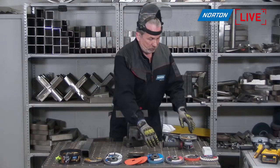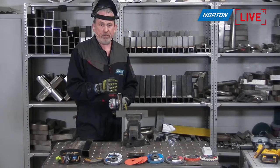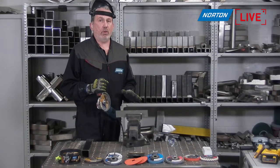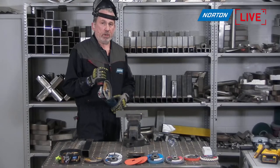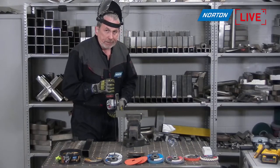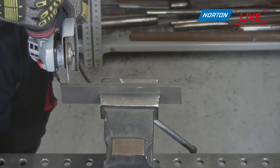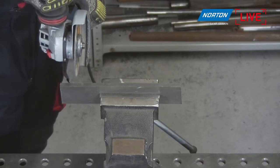When cutting, you must never cut at an angle — always cut at 90 degrees to your component. On pressure: don't push too hard. If you put pressure in the cut, you lose control of the machine and the disc. Just let the abrasive do the work and control the position. Also, these discs are not great at going around corners, so always keep a straight cutting line. Never try to flex the disc inside a cut and cut at an angle — always keep it in a straight line.